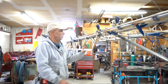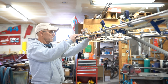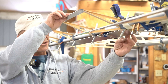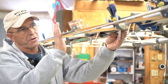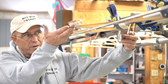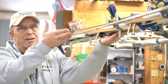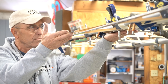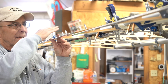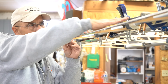One thing that's really important is the alignment of the bottom of the leading edge on the aileron. The way this works is that the pointed leading edge — when you work the aileron up for a turn — should immediately enter the airstream and help you. If it's too high it takes too long and makes your ailerons harder to work. You want it level so it immediately enters the airstream as soon as the aileron starts coming up. Where the flaps go is pretty much based on where the aileron winds up, because I want them to be the same distance from the trailing edge.